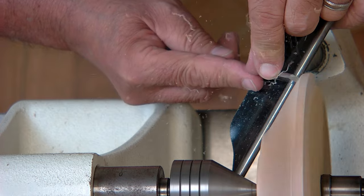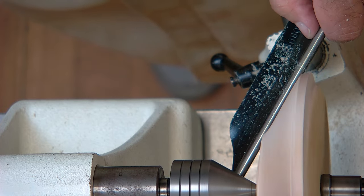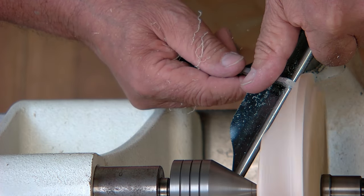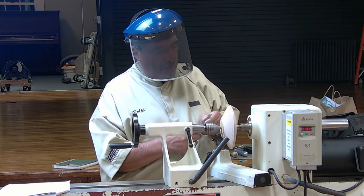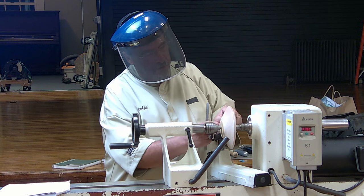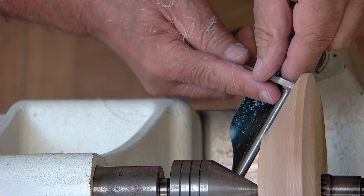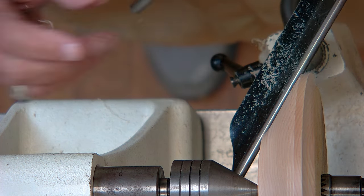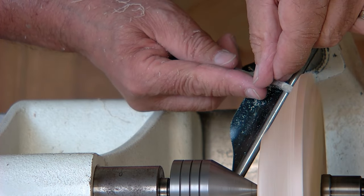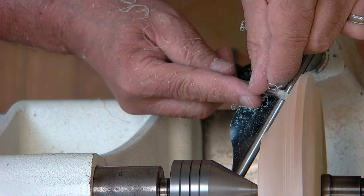I'm coming in nice and slow. You don't cut the bead completely in without setting up the next beads. The main reason is if I cut the bead completely at the top, you're going to have a wider space and you won't know whether you go over this way or that way — you have a tough time keeping the bead width uniform throughout the piece. What I normally do is come in here and just mark each of the beads before I go in and cut them all.